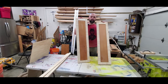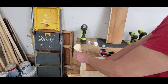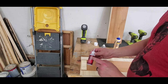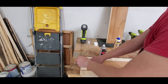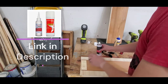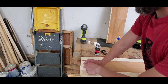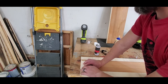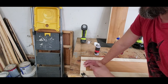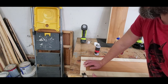Here are the first two strips done — let me show you my glue-up process. I'm using Titebond 2 as my wood glue, which takes at least 20 minutes to set and maybe two hours to dry properly. So I'm also going to use some StarBond adhesive — basically super glue — and add it in the middle, then hit it with accelerator to dry in roughly 30 seconds. The benefit is that once the StarBond sets, it holds everything clamped while the wood glue dries for a strong bond. Without the StarBond I'd need tons of clamps, and even then regular wood glue causes pieces to slide around and makes it hard to get good contact.